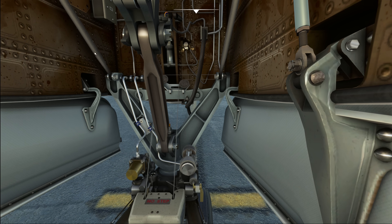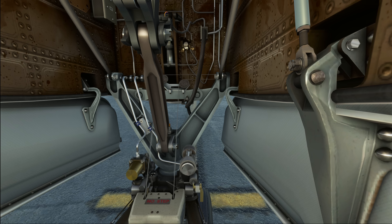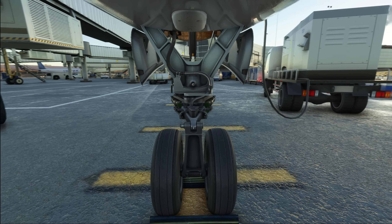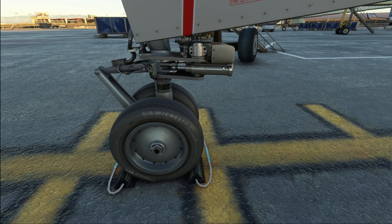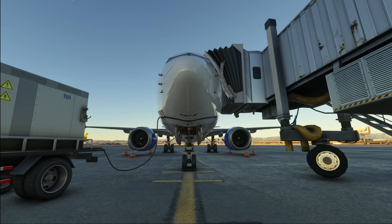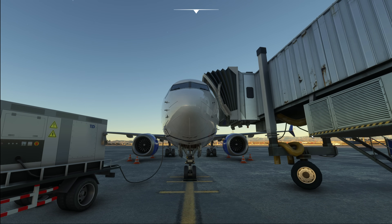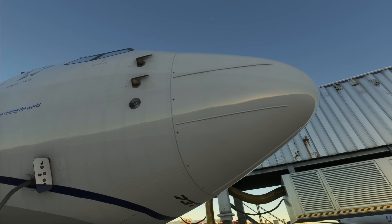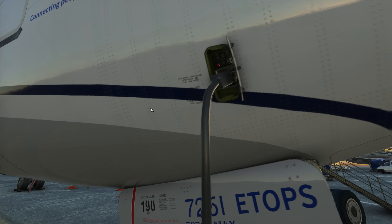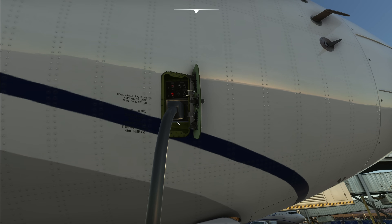We check the condition of the nose wheels themselves, making sure there is no damage to the tires, that the tires are properly on their fittings, and that there are no fluids leaking. We then step back for a general overview of the aircraft, making sure it looks straight and nothing is broken. Moving along the fuselage, we check the first officer pitot and standby pitot probes, the AOA vane, and if the external power access panel is open we make sure there are no damages and nothing in there that's not supposed to be.